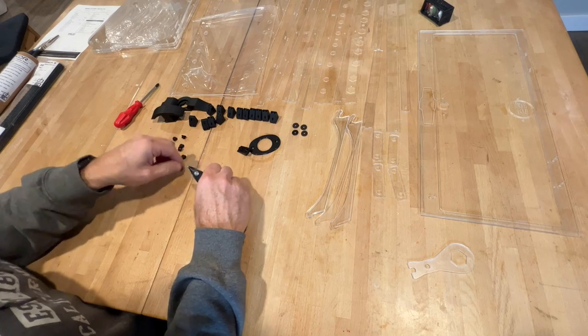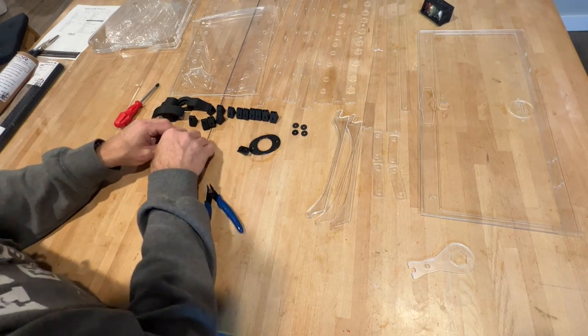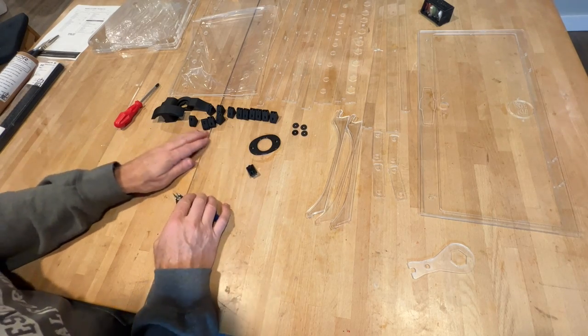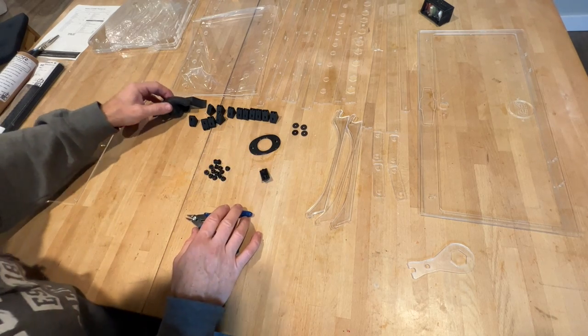While you're trimming the flange nuts, you'll notice they are flat on one side. That's intentional so that they index in and basically act as a plastic nut that the thread-forming screws tap into. By having the keying, they're held in place in a panel position so they do not rotate while you are trying to thread a screw into it. Just a couple minutes of prep work goes a long way to making the whole process smoother, easier, cleaner, and more enjoyable. Take your time.